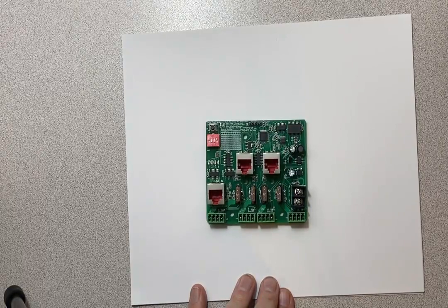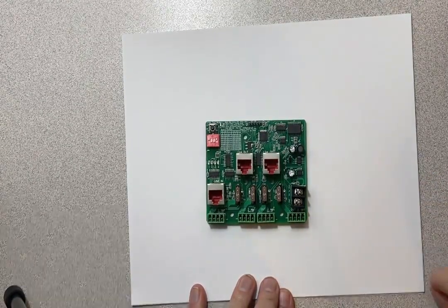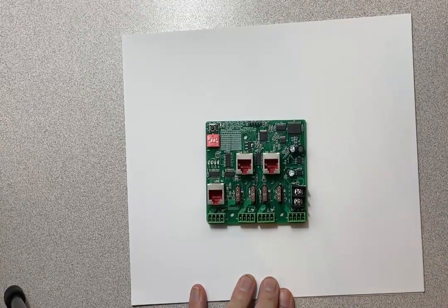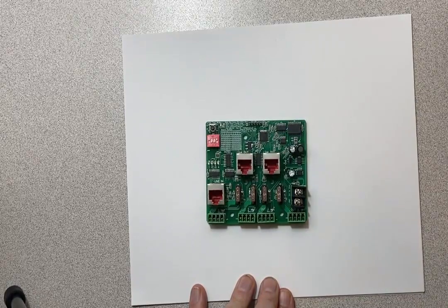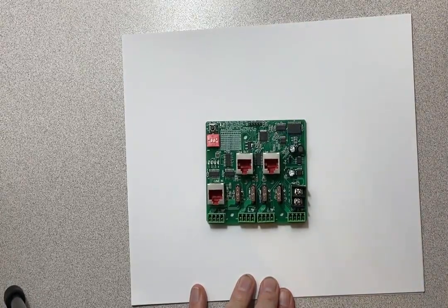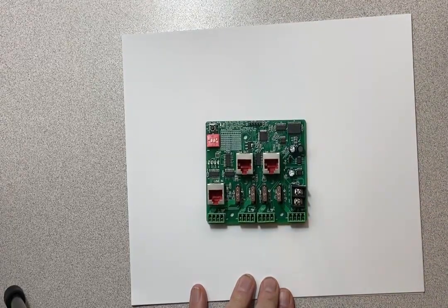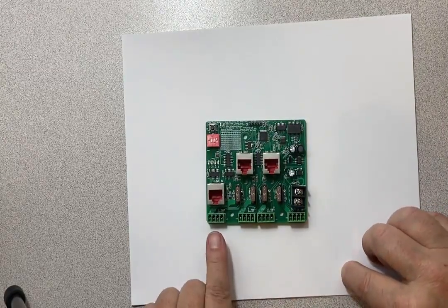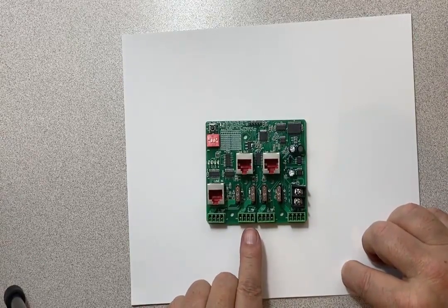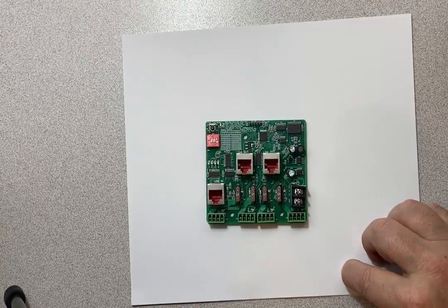Now, in the configuration page, how do you know what pixels are going where? Very briefly, consider the Cat5 having a data stream of, we'll just say, 680 pixels. The very first pixel that comes out is pixel 1, and it goes all the way down until you have pixel 680. If a port is activated, you tell it what the first pixel should be coming from this port. So, this could be port 1 off of data stream 1. This might be pixel 101 coming off of data stream 2. So you're allowed to pick what's the first pixel that's activated coming off any one of these ports.